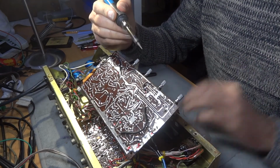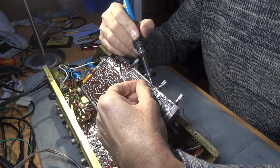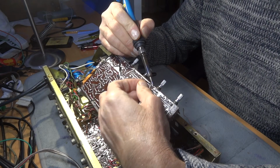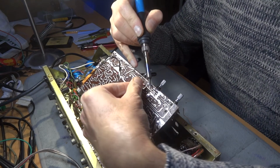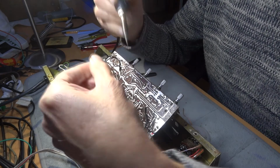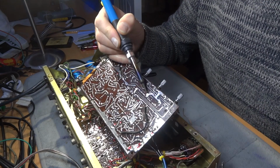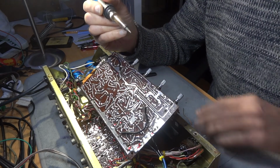We're just going to take this wire off, and for the wire we're probably not going to need any braiding at all. Just going to introduce the wire there, the soldering iron there, and that wire just lifts off quite nice and easy. And hopefully you can see, we'll just go over the other side, and there you go, the wire's completely away. Right, okay, let's not lose that.